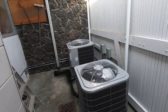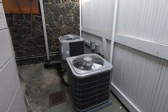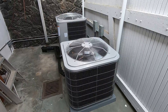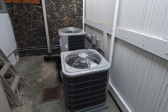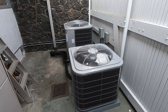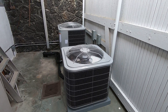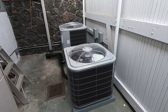The main difference is that now they will be using electricity to heat their house instead of gas. Obviously a gas furnace comes on, heats your house, and goes off. Now when the heat comes on, it's electric. This heat pump condenser out here switches with a reversing valve and will do heating or cooling for AC. So when you are actually heating your house, this condenser is running outside. We are in heat mode right now, so the house is heating up. The heat produced by a gas furnace is different than an all-electric heat pump condenser.